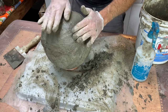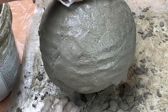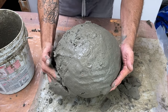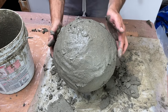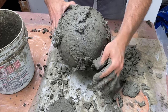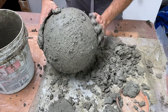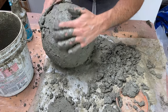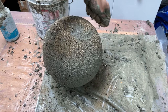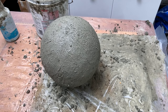Making sure the surface is really wet — but do you see how that's falling off? Look at the bottom there — see how it's lifting off the ball. I was like, okay, I'm going to save this. I went to make another mixture and then that happened while I was away because I left the camera running. So I knocked off what was falling off and then tried to save it with my new mixture. I took off all of the batch that was too crumbly — it either didn't have enough cement, enough water, or enough polymer in it. I started rubbing the new mixture in with what was remnant and wetting it thoroughly, and I added some sand too.